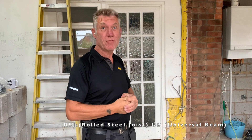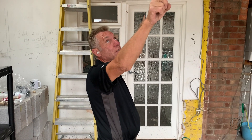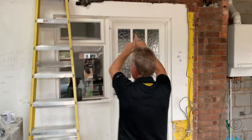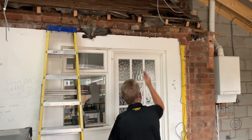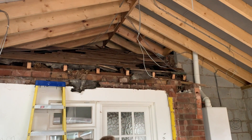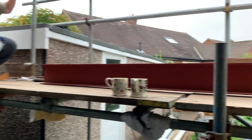Right, this morning we've got to get in our girders - our RSJs, U-beams, whatever you call them. We've got to put a U-beam up the top here called the ridge beam. We need to get the genie and put our RSJ across, which will support the wall plate. There'll be a post going up from the RSJ to the ridge beam, bolting it together and holding it. Our problem is getting the RSJs and U-beams round into here - we've got to come over the scaffold through a narrow way. We've got one round but we're going to film the next one to show you what we have to do.